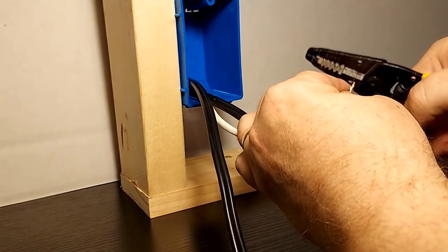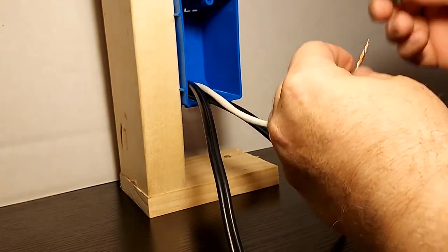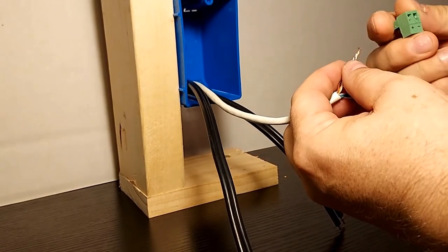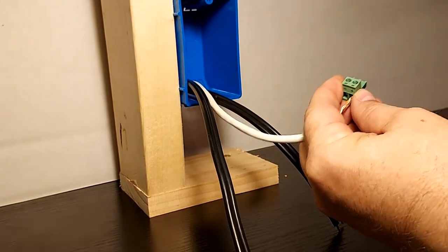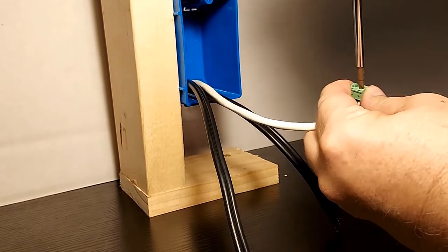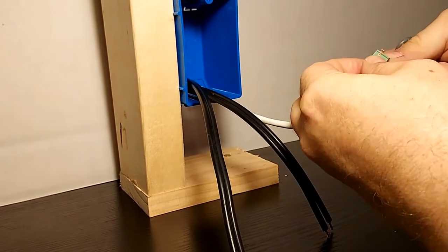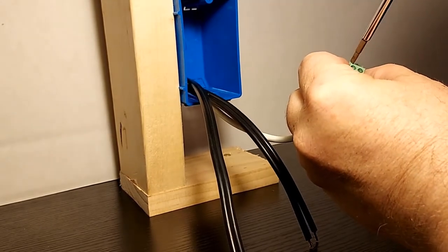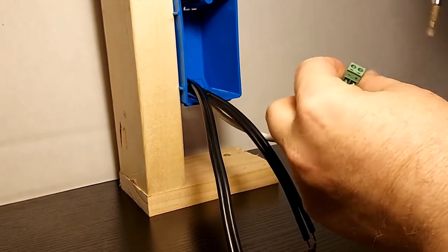Make sure they're good and twisted, and we want to make sure there's not too much copper, so there's no uninsulated wire hanging out at the end of the contact strip. It's easy to install the terminals because we can pull them out of the keypad. Make sure we have the polarity correct — this is positive — and then we'll snug down the screw. Nice and tight, so let's install the negative. Again, snugging it down, and we'll want to make sure to remember how we configured the wires in here when we're back at the power supply so we get everything correct.